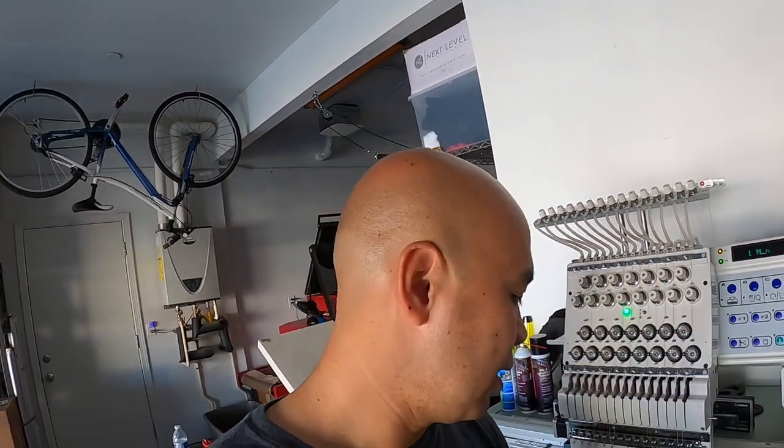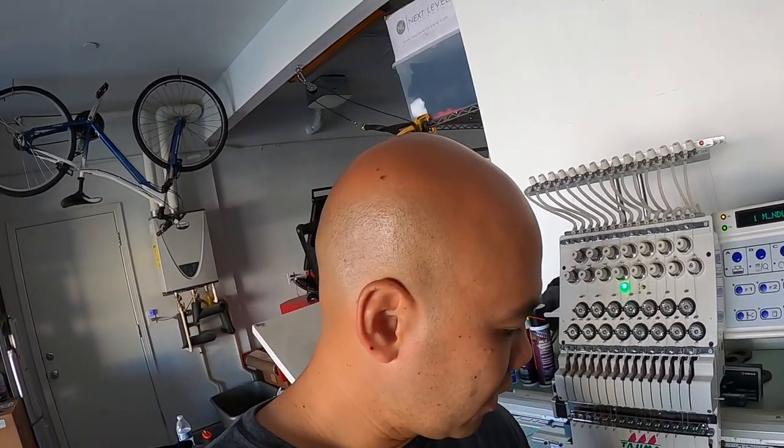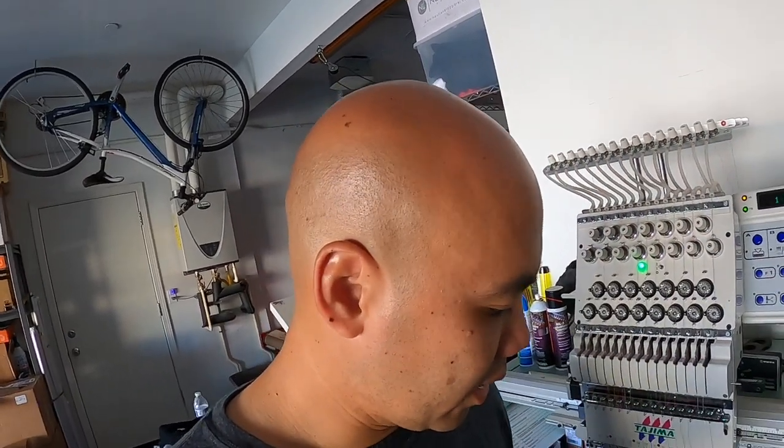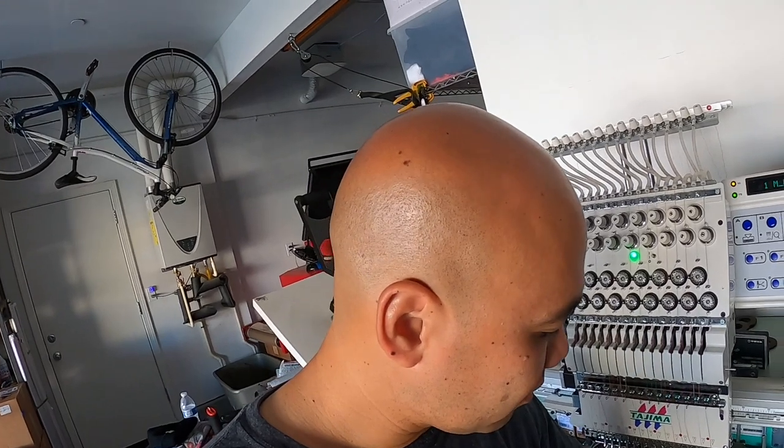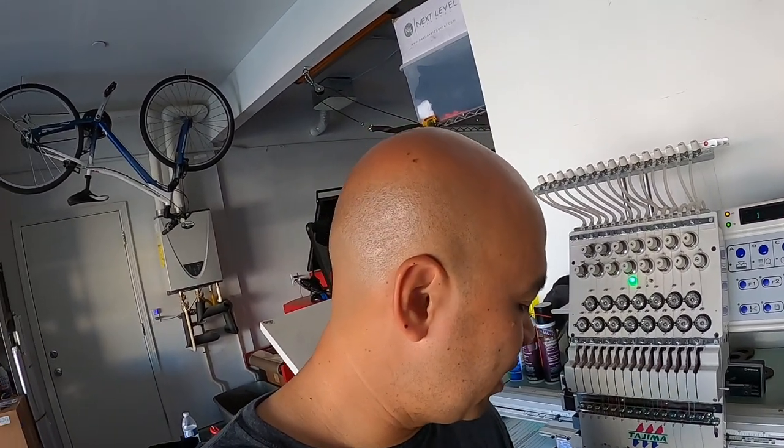This machine has a built-in — or it was already changed over to — the USB emulator, the flash drive. I lost the original flash I've been using for this one, I think it fell. So I grabbed a 16 gig flash drive — didn't work. Grabbed another 16 gig — didn't work. I called the person I got the digitizer from, he sent it to me, tried them again, these two didn't work. Talked to Juan and he said it might need to be at least a 4 gig — actually it only reads up to 4 gig; anything more than that it won't read.